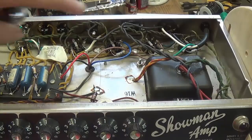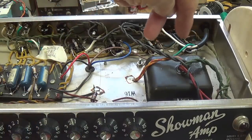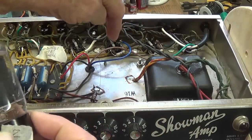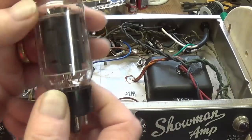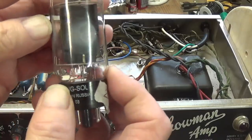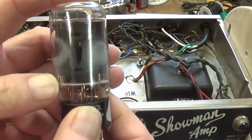The final bit of evidence was that while I was doing some more testing, and these two tubes here were like 20 milliamps, the number two tube, which is this one here, and in our earlier test actually showed the highest plate current, actually just burst like a flash bulb and developed internal shorts between every single component. Okay, you can see from the outside, this is a blown tube. Now, that pretty well ruined my matched set of four tubes.